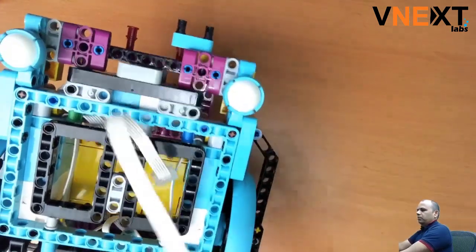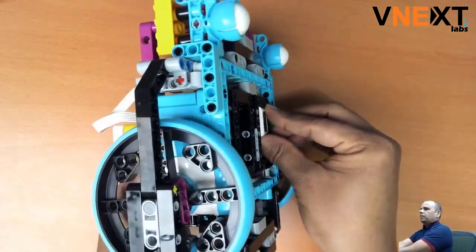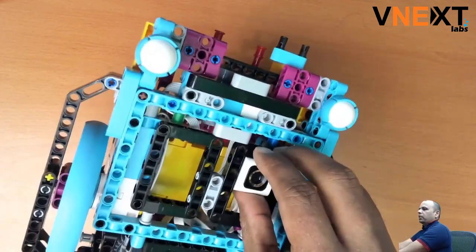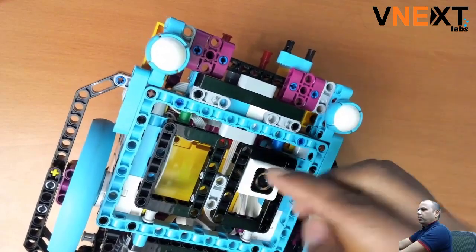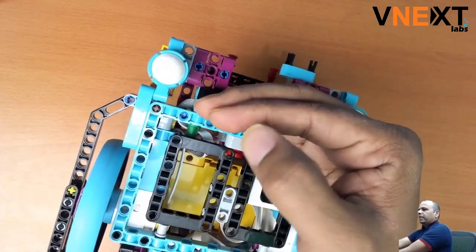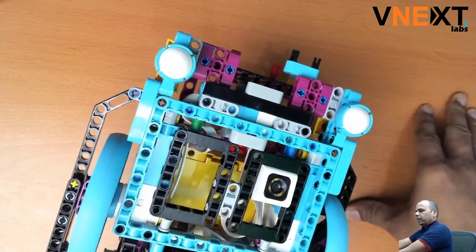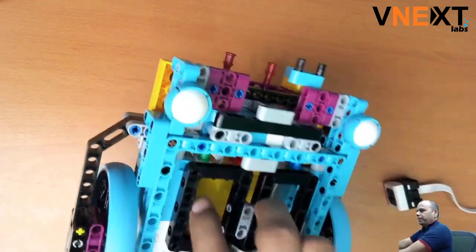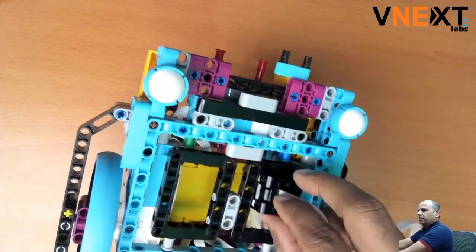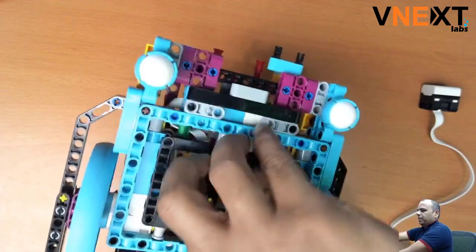The sensor ideally needs to go here, flush with the surface — not sticking out at all. We'd actually want two sensors, since two sensors are quite useful for line following: one sensor follows the line and a second detects a cross-line indicating where to stop. Many FLL replay board setups work this way. The challenge is placing them neatly — there's not much space to connect the springs, but after some finagling, you can take the frame out completely.